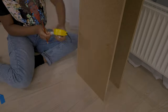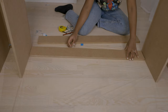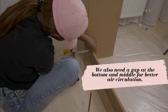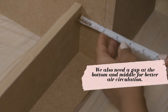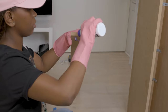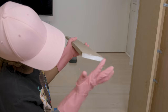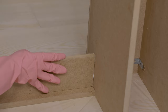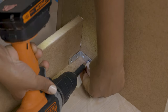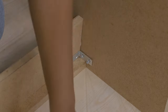We're going to have two towers. I took my tape measure and measured the sides of the towers where I wanted to place the bottom piece, which was going to be the middle. The one lying flat on the floor is a spacer — a piece to this whole puzzle. I marked using a pencil where I wanted to place this piece, applied some wood glue to the sides, placed it in between the two towers, and then used angle connectors to screw them in, joining the middle piece.